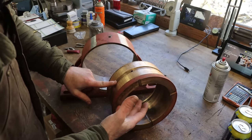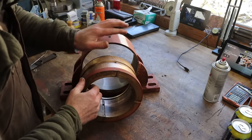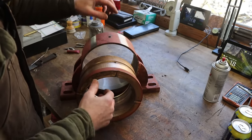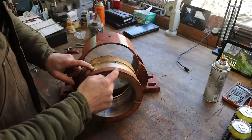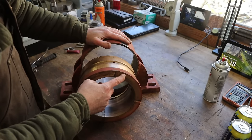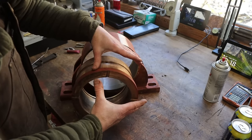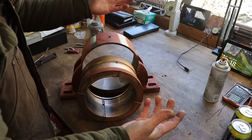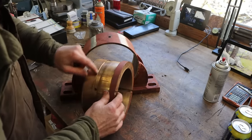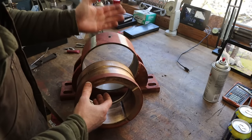But what I'm going to do is press this thing back together, just get it squared up to where it looks good, and make sure that it greases the way that it's supposed to once it's together. I will fasten this bearing to the housing. That way it just ensures that the bearing stays put in the support and doesn't lock up on the actual ball mill piping and cause problems. So I am still doing exactly what I was told to do. We just did not know that this had a slot around it, which changes whether this needs to be clocked or not.